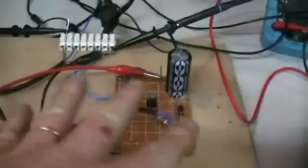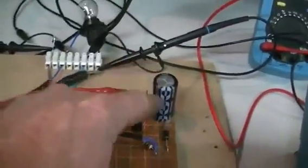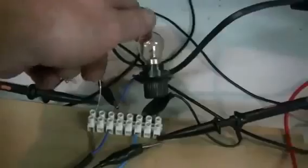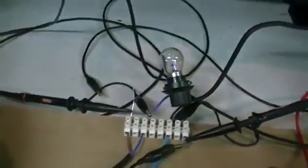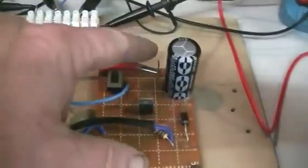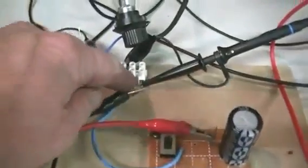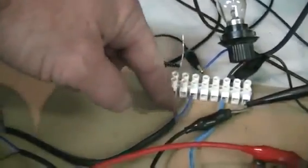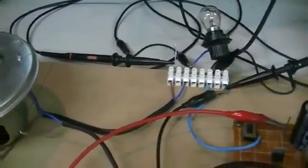So just our basic circuit: a smoothing cap of 3300µF to try and smooth the pulses out — it's got rid of most of them, so our meter will be fairly accurate. That's just a 12 volt automotive globe, a tail light. This meter here is coming off the positive side of our cap, going through into our globe, and then out of the globe through the switch. The other meter will be reading the current from our 12 volt battery supply going to the motor. I'll hook it up to the positive side of the motor and away it will go.